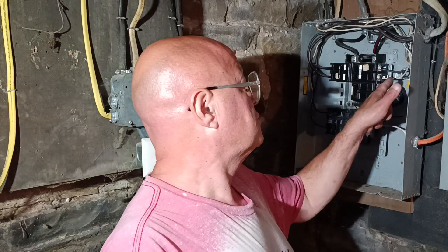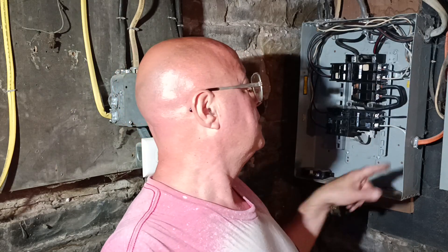That is how to neaten up a panel. In the country I was born in, we use 14 AWG on 15 amps, 12 AWG on 20 amps, and 10 AWG on 30 amps. Black is live, white is neutral, and bare or green is the ground. Red and blue are also live colors. However, you may find white live in a switch loop or a 220–240 volt circuit, such as these baseboard heaters and that water heater. In a switch loop you may also find the white wire live. Thanks for watching.